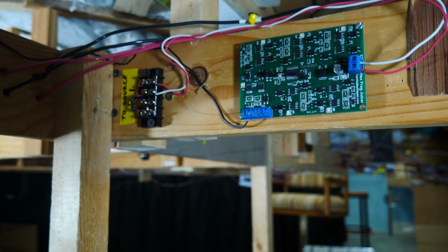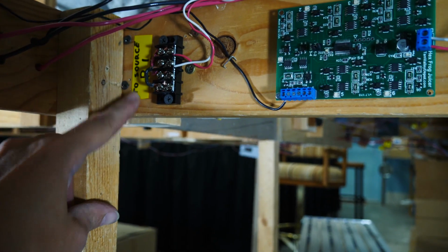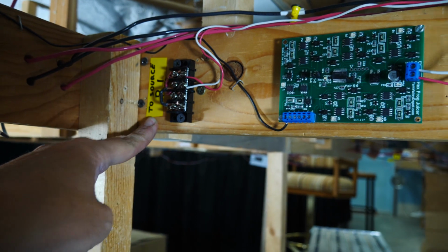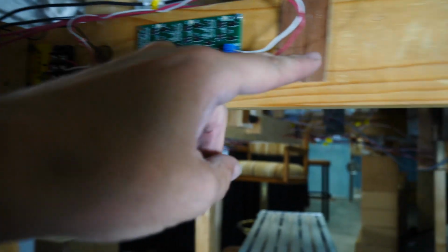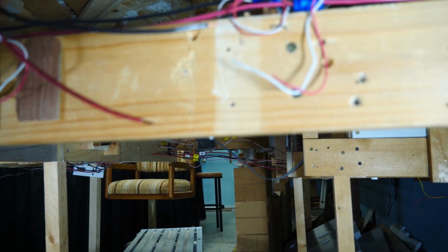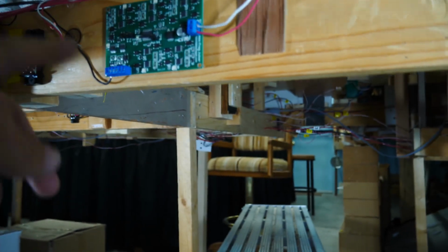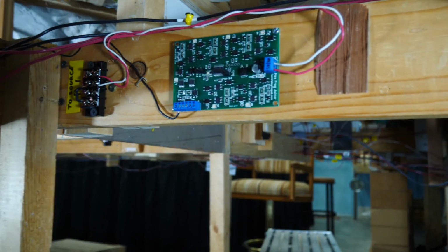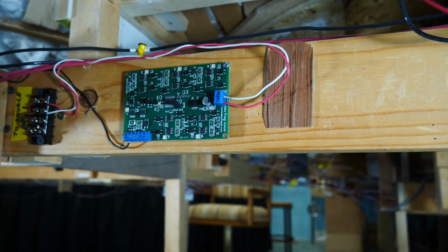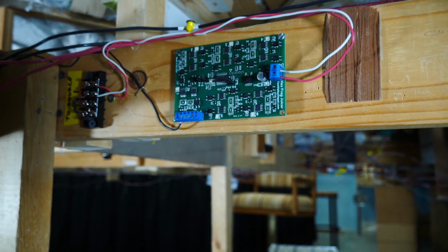We're under Kenosha Pass now. So I ran bus line into here. This goes to the booster. So it's fresh off the booster, then it can go through, and here we'll have our reversing circuit board. There's the wires to connect onto it. I had to splice this in somewhere else. This is a frog juicer using one of our turnouts. I actually bought that for doing the three-way turnouts, which I have not got to yet. Give me another couple years.